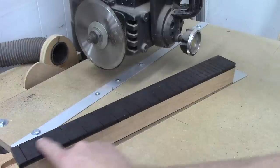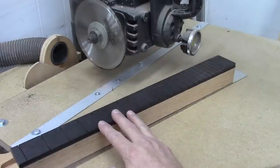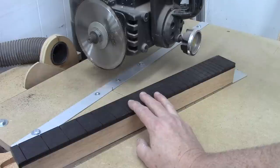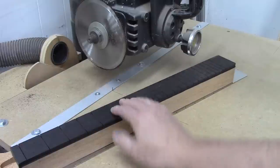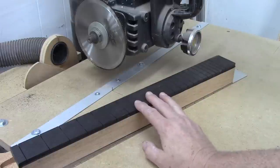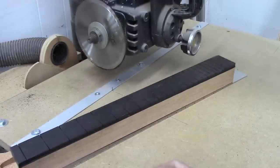Okay gang, you can see that all of our fret slots are good to go, and our StewMac fret slotting blade worked great with our StewMac fret slotting template — link in the description for those if you want to buy one. You don't have to have a radial arm saw to do this; you can do it on a table saw, you just need something that this blade will fit on. People often ask if you could do it with a power miter box — I'm not going to say no, but I haven't figured out how to do that because I already have this tool that works.